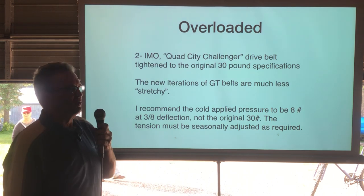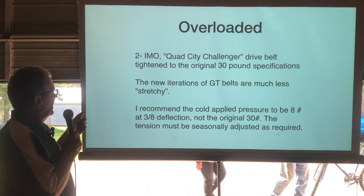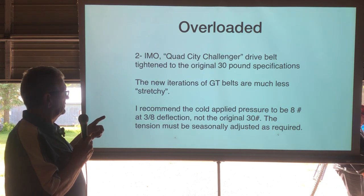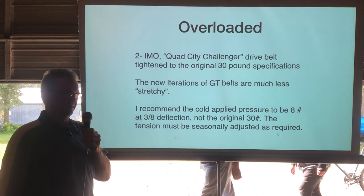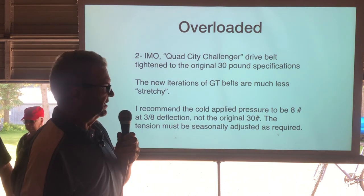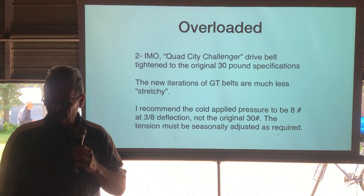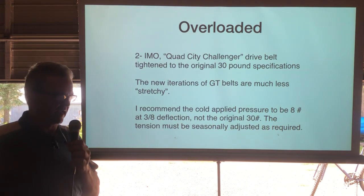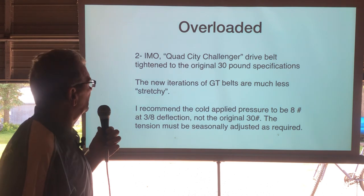If you set it to 30 pounds on the ground, I have no idea how tight it is in flight — but it's really tight. Picture the bearing with its balls nicely spaced by the cage, and the belt pulling so hard on the crankshaft that the fiberglass-reinforced polymer cage actually breaks — the balls try to move away from the load side. The failure signature for an overtightened belt is a cage broken into little pieces. It's not the bearing's fault — it's overloaded.